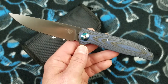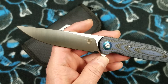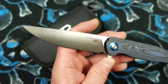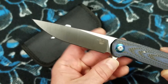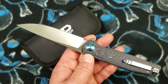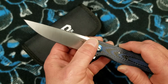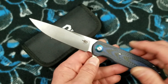As far as toughness goes, D2 is not the toughest as far as impact resistance goes. I don't like D2 ground too thin; I don't like it as a chopping steel or in a big fixed blade I'm going to be chopping with. But as far as a folder or a small fixed blade, I think it's an excellent steel. Corrosion resistance — it is not fully stainless, but it is fairly stain resistant. Just wipe the smuts off when you're done using it and maybe wipe it down with some mineral oil. It doesn't take any special rituals.